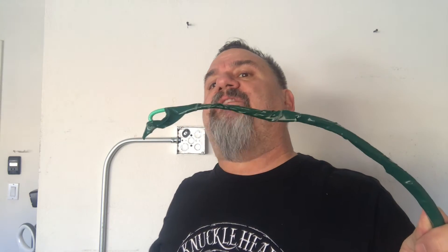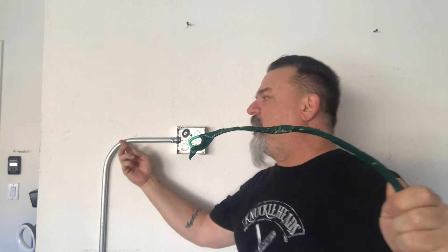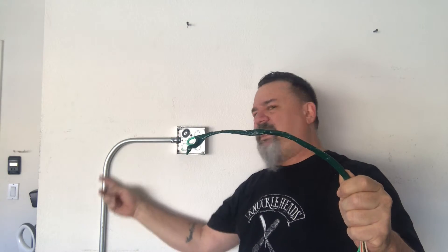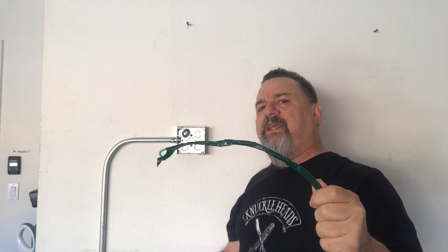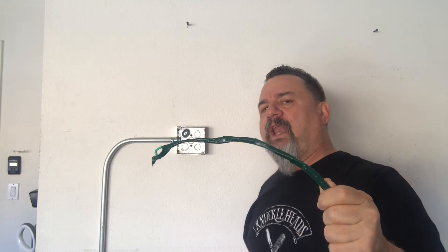There are different ways to protect against the eye pulling out. I'm going to show you an easy hack for what to do if the fish tape comes off, or if you pushed the wire and it didn't quite get inside the box — you could hear it coming around and feel the pipe getting heavier as it gets stuck.